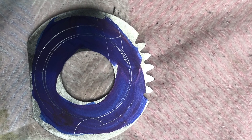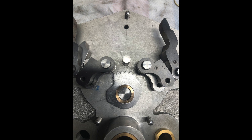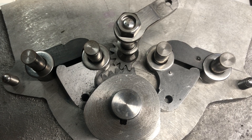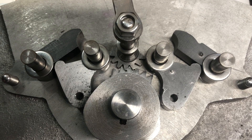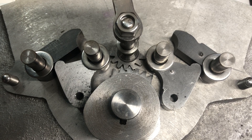This is the beginnings of the manual decompression cam. It runs behind the main camshaft, and its idea is to help the engine to start. To start these bikes they're either pedal started or towed with another motorcycle to get them up to speed and get them running. To initially crank the engine over you need to release the compression in the engine, so that's what this little mechanism in the back of the camshaft is for. When you move this lever over it actually lifts up the exhaust rockers, which then decompresses the cylinder so the engine will rotate over smoothly and easily. Then as some momentum is gathered in the engine the lever is released, and the engine has its full compression and off it bumps — and we're off and running.